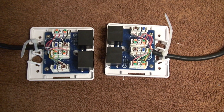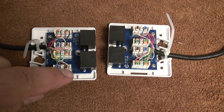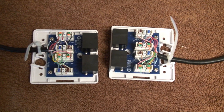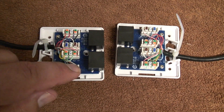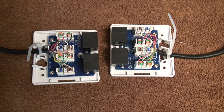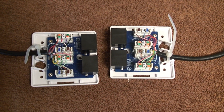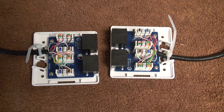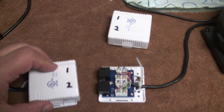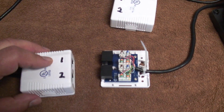I had a little issue where some of the wires hadn't been punched down completely, so some of the buttons weren't working. I just went through one by one and made sure that the wires were all completely punched down. As long as they match up, this works great. So I'll just put the caps on and get everything set up.